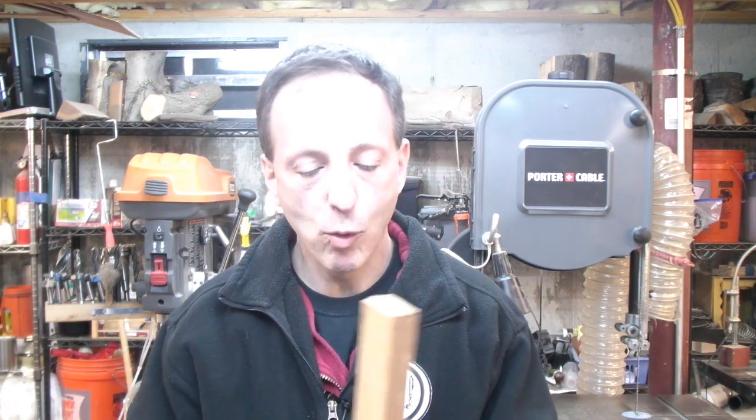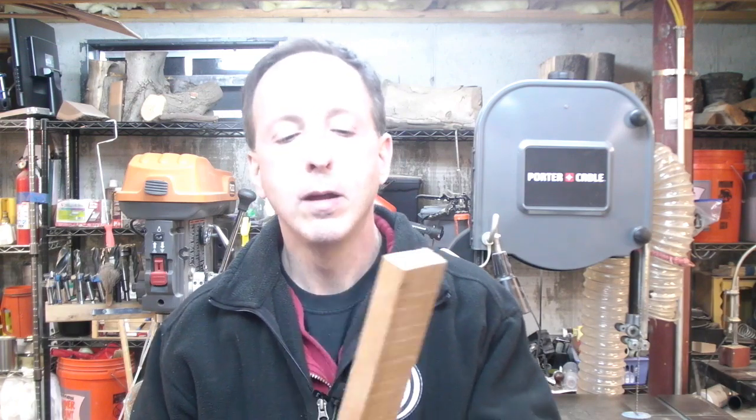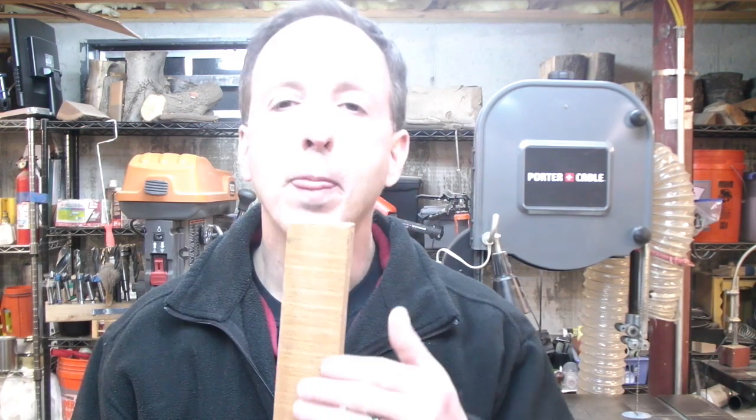If you're looking for something a little more exotic, you may find yourself going to a local wood mill. Typically, though, when you go to a wood mill, you'll find the material is only smooth on one side. The other side is not planed. So it's not ready to be used yet, and you need to take that into account. It's extremely important when you're planning your project to consider what you're going to make it out of. Stick with the big box wood. 3/4 of an inch is where it's all going to start.